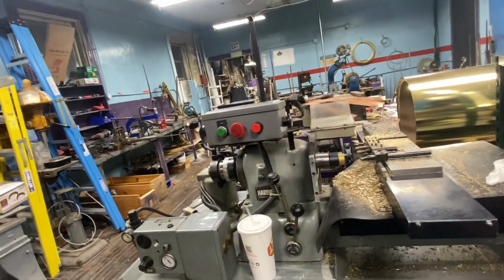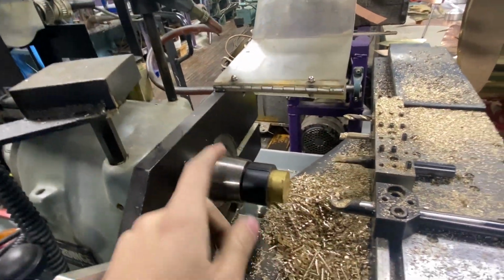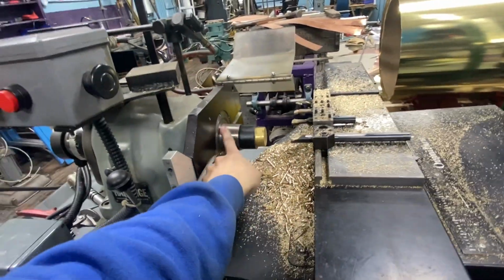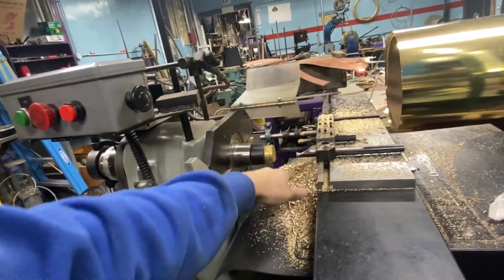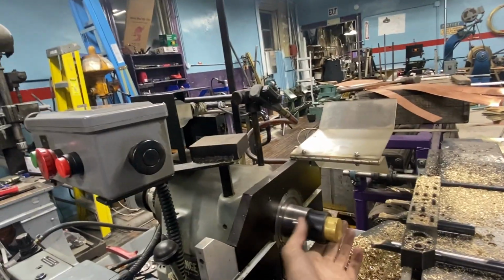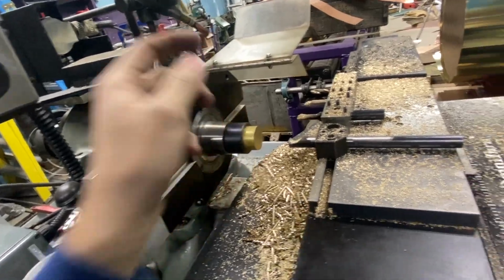That's like 27 millimeter, I think. The super cool thing about 5C is you can machine a step collet. 5C max diameter is 1.1 inches through the bore. You could realistically have up to like a 6-inch piece. Now I wouldn't put a 6-inch piece in here, but 1.5 inches is definitely within possibility. So that's super awesome because we have some projects coming up where we need to do that anyways.